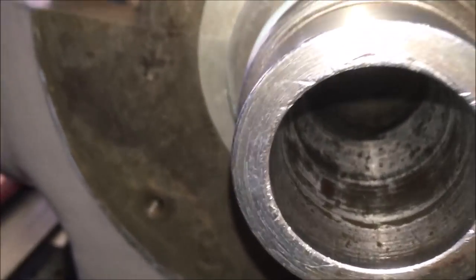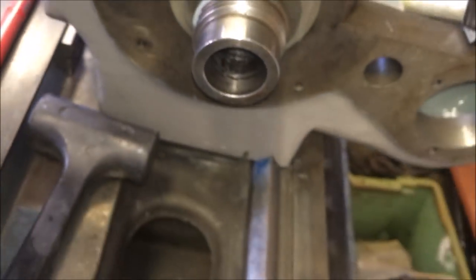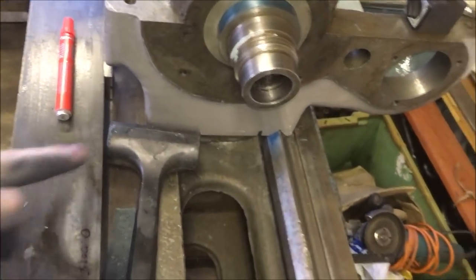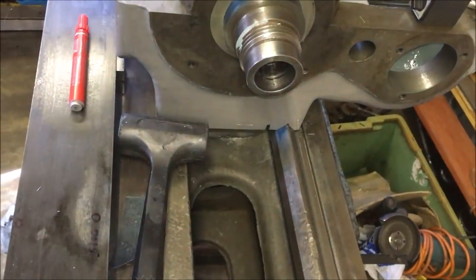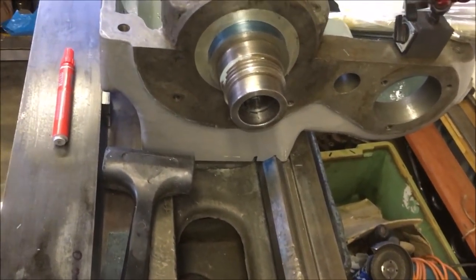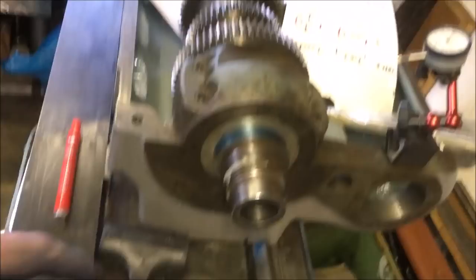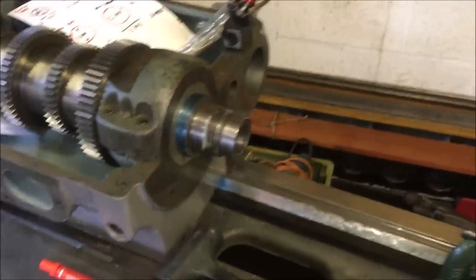I mean, once the lathe's up and running, I can get myself somewhat sorted out with some kind of tool post grinder, an internal die grinder, and bring it back to good. But the lathe ain't running and I need a test bar in it to set up the alignment of the spindle to the bed. Thus the last 2 days cocking about.